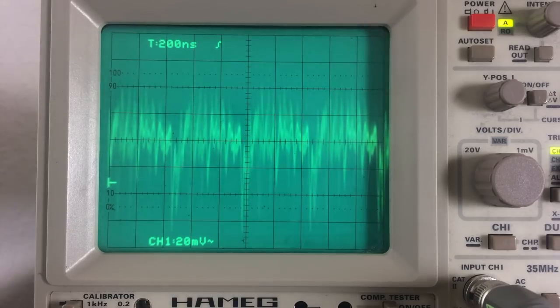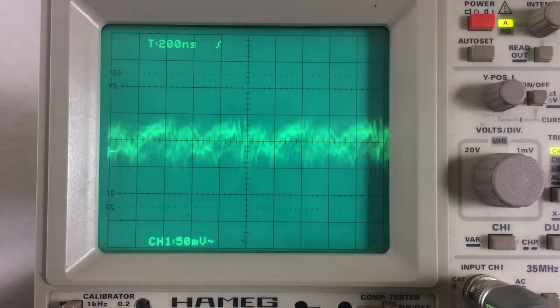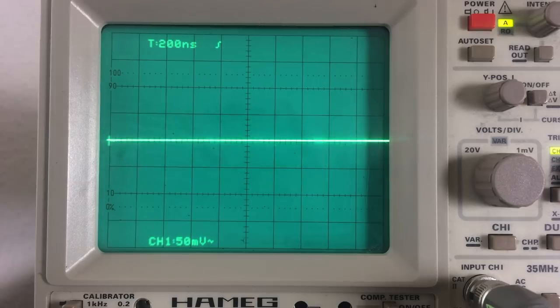Let's look at what actually arrives at the VIC2 itself. This is pin 40, which is the 5-volt supply pin. This is quite a bit noisier. This is the noise on the 5-volt pin of the PLA, which is fed by my external power supply — the one I built in the previous video, using a 5-volt switching supply for the 5-volt rail, which I haven't had any problems with. It's a pretty good supply but still noisier than what our DC-to-DC converters are outputting directly.